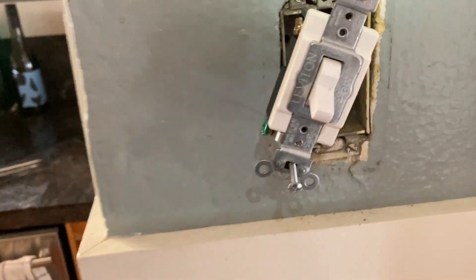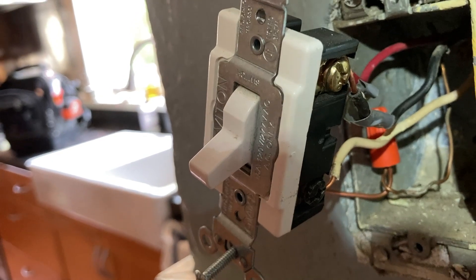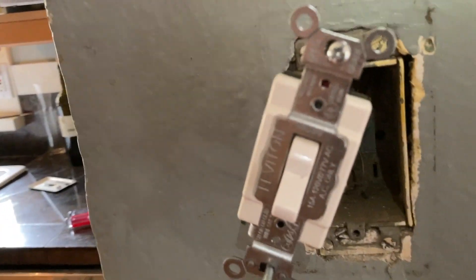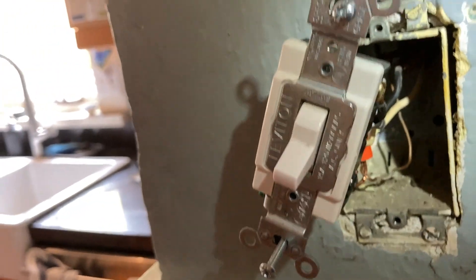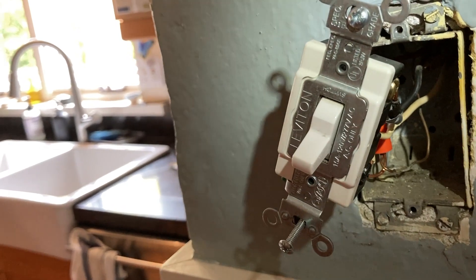There are a lot of problems - I don't know if you're ever going to be able to address this without moving some of that stuff in storage and taking up some of the floorboards. And then there's the 60 volts stray voltage on that circuit because it runs all over the house - it's been patched like crazy. Obviously there's some path to ground where there shouldn't be. Just for grins, as I was screwing things back together in this box, I wired it the way I thought it should be wired - with that black wire with the tape on it as a traveler and the white as the line in. I'll be darned if the lights are working perfectly now!